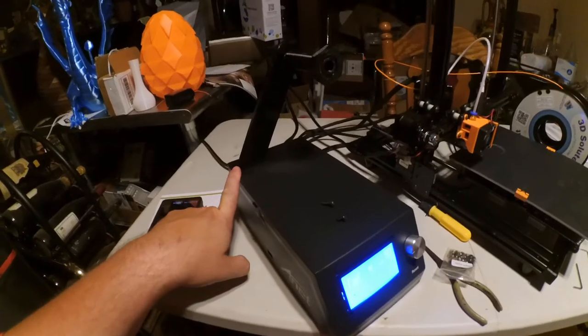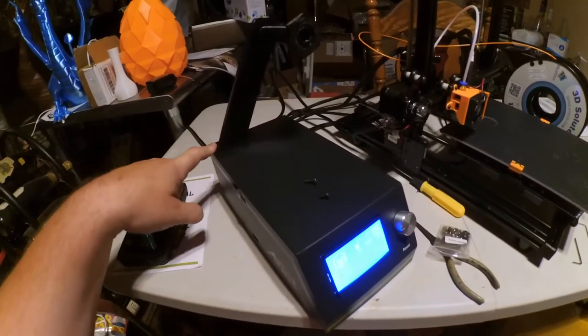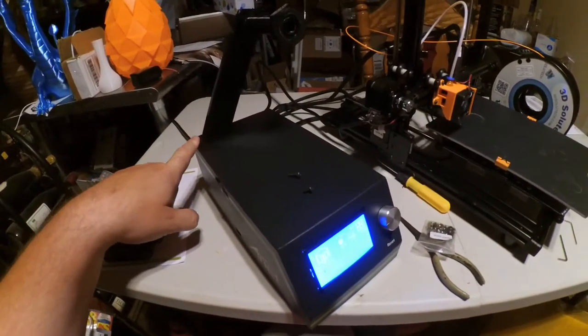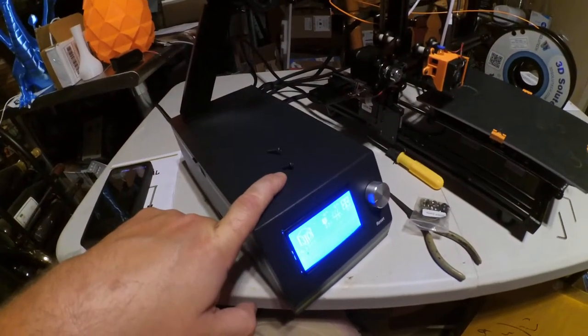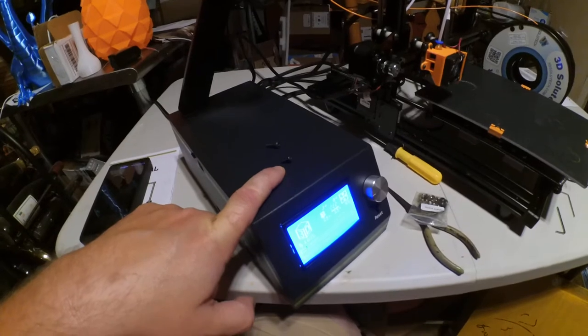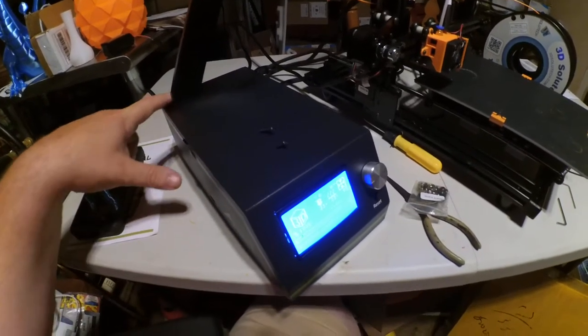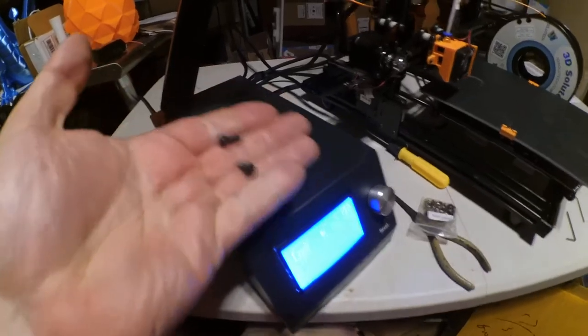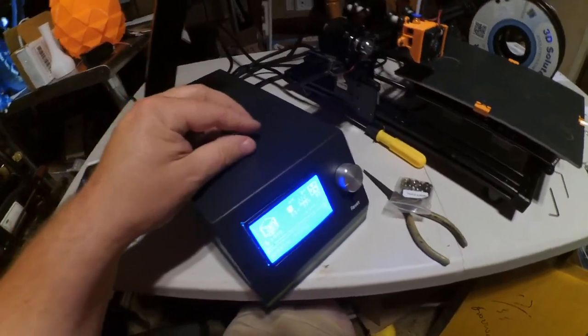40 by 40 by 20 fan. These bolts actually go in too far and they hit the fan, so you can't tighten them down all the way. But that's okay. Go into your spare parts bag and grab two of these panhead, I'm guessing they're M5s, screws out of your bag and use them instead. And they fit perfectly. So you can just replace the two cap screws back into the spare parts bag and use two of these instead, and you're taken care of.